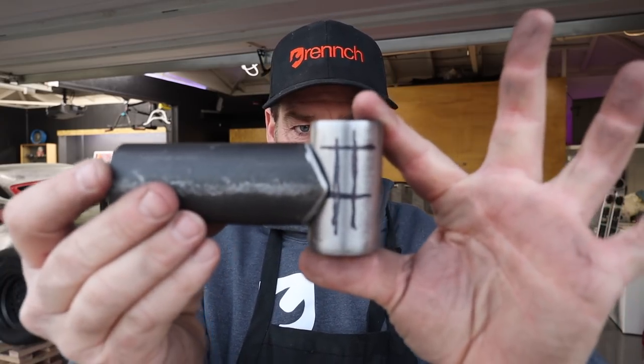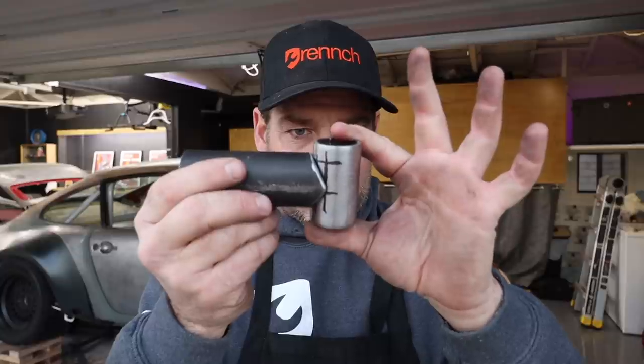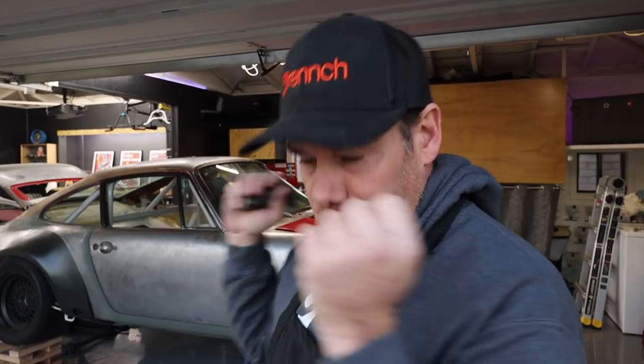Basically I'm going to weld this thing now to my new extensions that I made a couple weeks ago. I think I have a plan — I've just attempted my first hand-notching of a tube. I just cut a little chunk off and tried to notch it to this piece. You can do that with a bunch of math — there are videos on YouTube about it. I've had to ovalize it a little bit because this tube is a little bit smaller than the other. The first tube I'm going to do is the longitudinal tube, connecting from the engine cradle to the two transmission bolts.